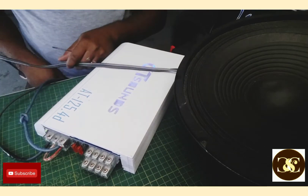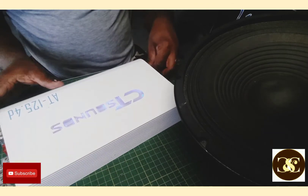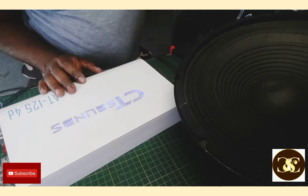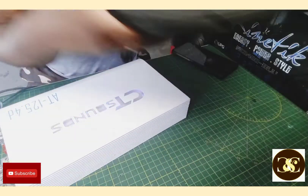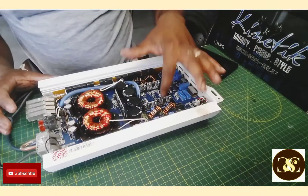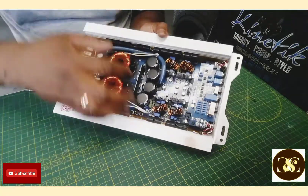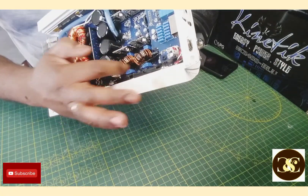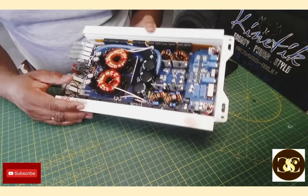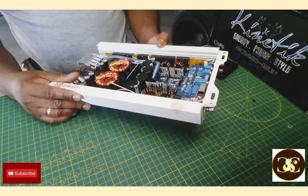Okay guys, that's it for this one. Everything's okay. Just that glue corroded the 10-ohm resistors right here beside the inductor. If you have one of these, please check right down here beside the output MOSFETs. I think that's going to be it for this repair.